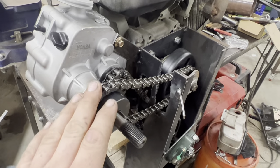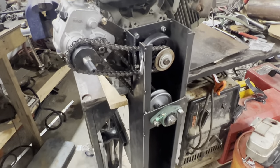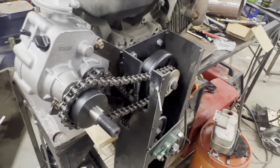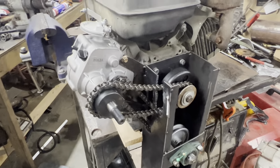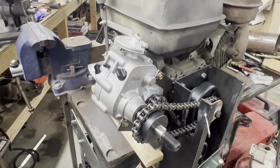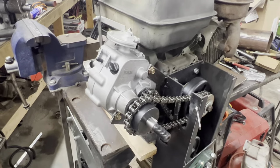Basically, he wanted surface drive so he could easily maneuver it, and he wanted reverse because with a long tail mud motor, you've got to swing wide to get that thing to go in circles - you get a steering radius of a school bus. So when you're out frog hunting and duck hunting, it's nice to have reverse, neutral, anything. So that's what he wanted me to do, and that's what I'm doing.